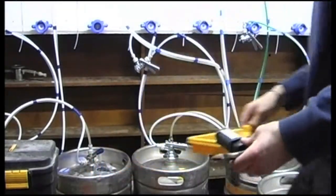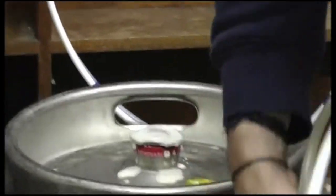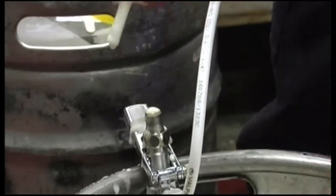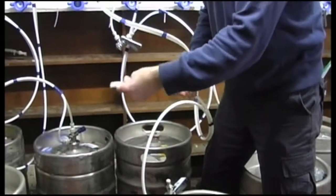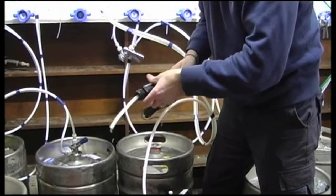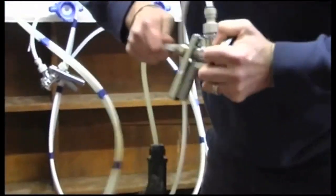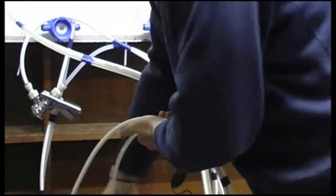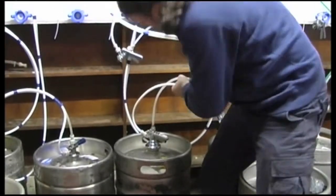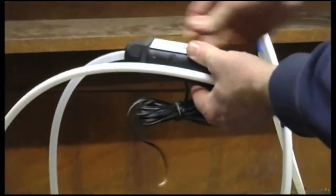Please note, this installation is being carried out while the lounge bar is fully functional with very little disruption to the beer flow and sales. Steve, our installer, first removes the broach head from the keg and proceeds to remove the beer pipe from the John Guest fitting. He then slides the BeerTech conditioning unit up the beer pipe, then relocates the beer pipe to the John Guest fitting, then locks the broach head back to the original keg, making sure all the fittings are replaced properly, then recharges the cellar buoy if needed.